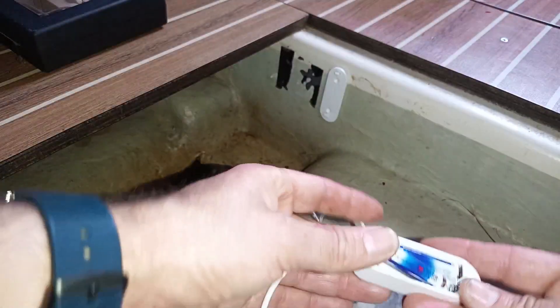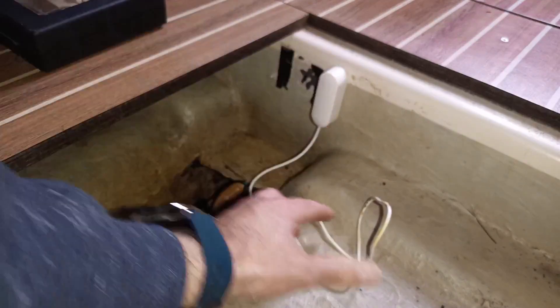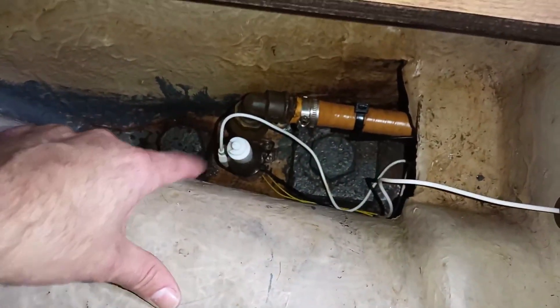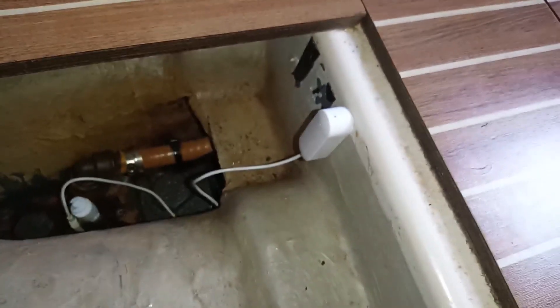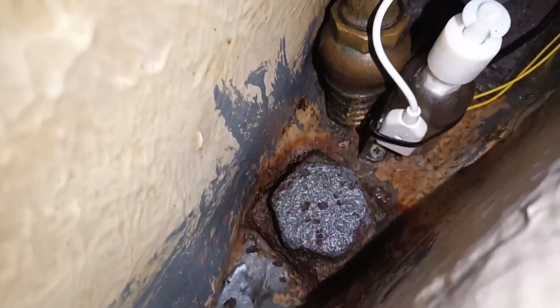If we're not on the boat and want to receive notifications that water is entering the bilge, we install our Wi-Fi module. We put in the batteries, and if the contacts at the end get wet, the sensor triggers a flood alarm. We place the contacts in the bilge at the point where we want to be notified. The other part of the sensor is positioned high enough so that water takes at least a few seconds to reach it after activation — giving it time to transmit the alert. We want the water to reach the sensor contacts, and during those roughly 10 seconds it takes to transmit the alert, the water shouldn't reach and disable the sensor unit itself.